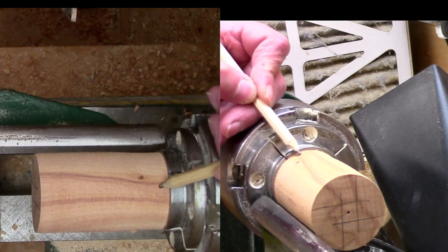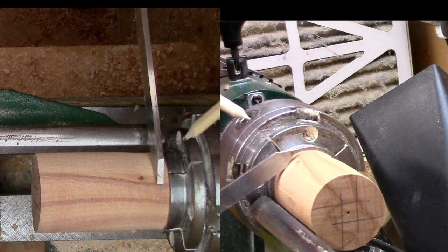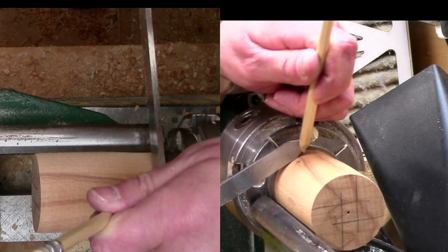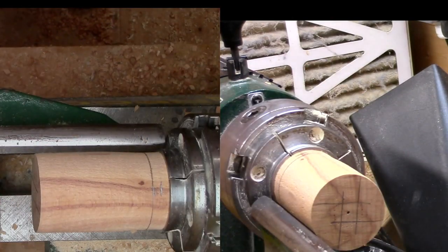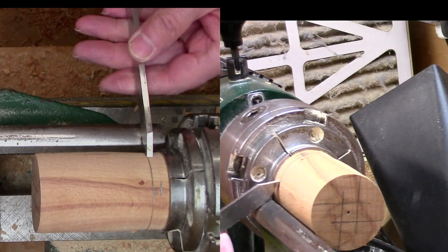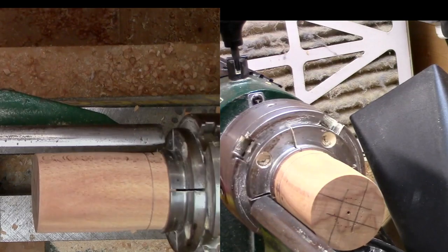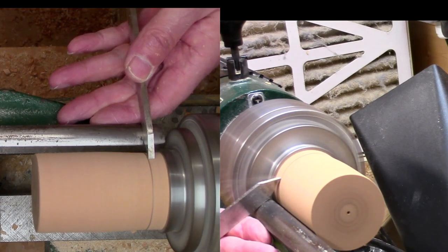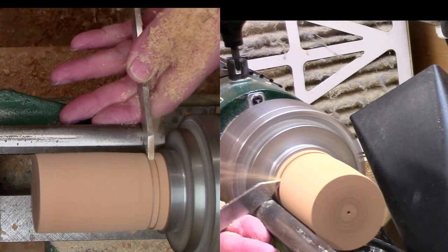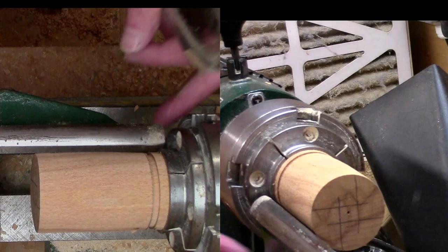I want to leave a space between my tool and the chuck jaws. We'll use a thin parting tool, but I'm marking with my thicker one first. I'm going to put a pencil line the full width of my parting tool — that will give me clearance because we'll go down in two goes. So that's marked up. We can put a cut in here just to define where the base is going to be. I now want to take this down at this thin end. The easiest way is to turn your tool rest at a slight angle.